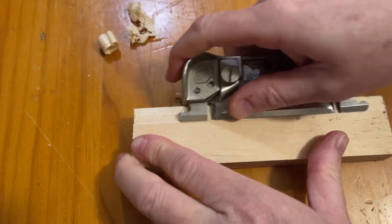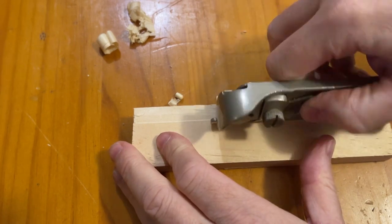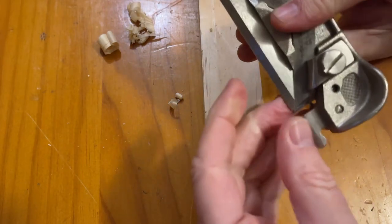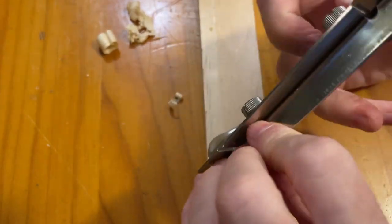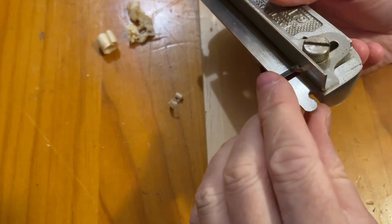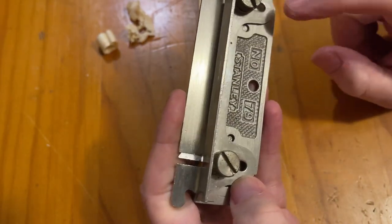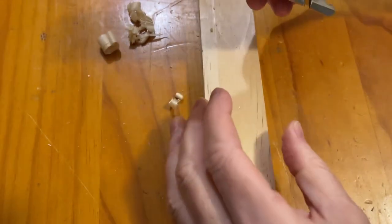These are ideal to be used on an angle to cut in and create a dovetail rabbet, but in order to do that you'll probably want to poke the blade out a little bit more and remove the fence, because the fence is square. It would be possible to create an angled fence to get your dovetail slot on either side exactly the same and at the right angle. Because it is pressed steel, matching this and creating a fence with the exact angle you want would be easily done, and then you have a very solid dovetail plane.